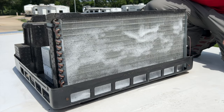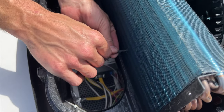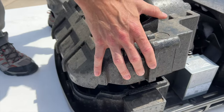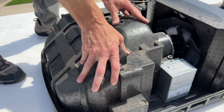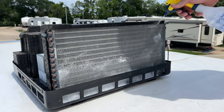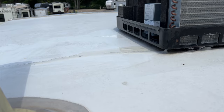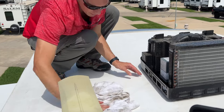The foam is still working on the outside air coil and we're done on the inside air coil. I'll pull the rag out of the bottom, put the sensor back in the right spot, and put the cover back on. Now we're foaming the outside air coil — it's pretty much broken down. We'll give it a rinse and clean everything out. You can see the dirty water coming out of the air conditioner, which means it's cleaning. Just for cleaning the coils, it takes about half an hour per air conditioner.